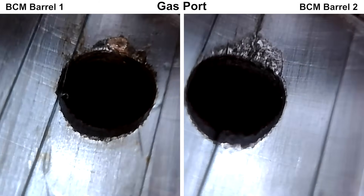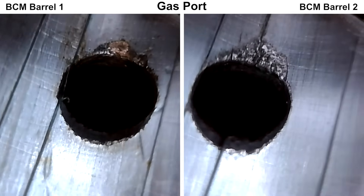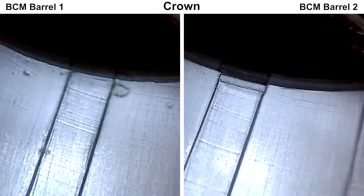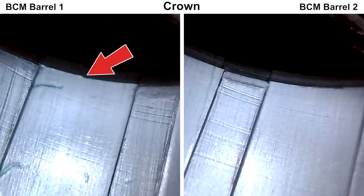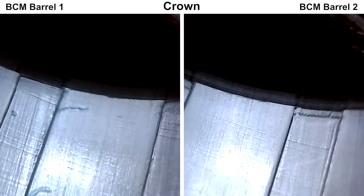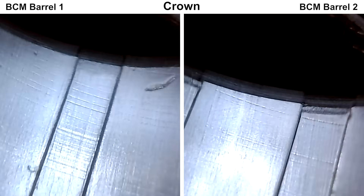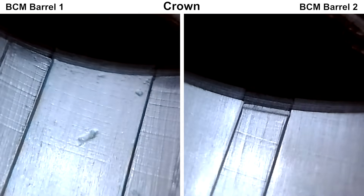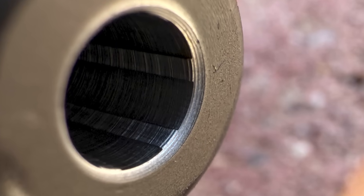Here's a peek at the gas ports — nothing much to see here, and since this was after shooting the groups, you can see some wear which is totally normal. And here's a peek at the crowns — again you can see some of those radial tool marks. The leading edge of the crown doesn't look super clean; there's a little bit of roughness to it. Also, on barrel number two, it looks like the edge of each rifling land is depressed or deformed near the crown. I'm not sure what happened there, but it's not confidence-inspiring. We'll see if that affects the groups. The radial marks in the bore are pretty easily seen with the naked eye under different lighting.